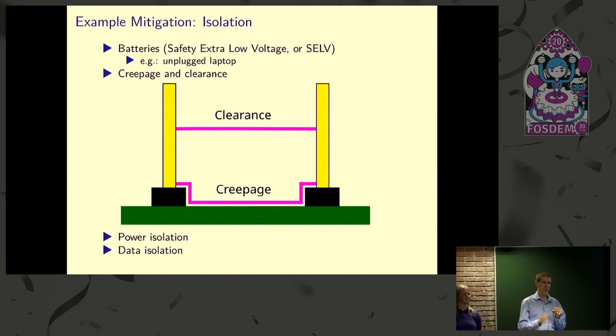This gets down to the idea that, especially if you're doing an ECG, someone may attach a defibrillator to the patient and put 5,000 volts or more through the patient. You don't want that getting to the person at the computer or other operators. So you want to have good isolation between the patient side and the side that the computers are on. So that gap there is making sure that we have that 8 millimeters of distance between any metal part on the board, on the isolated and non-isolated side. And there's two of them which reinforces. Yes.